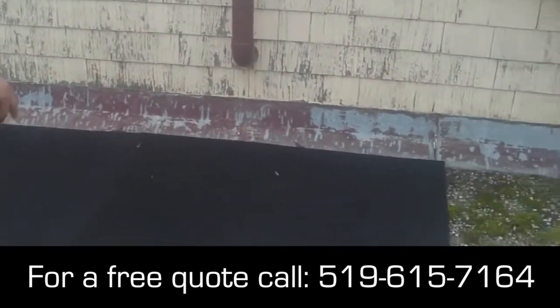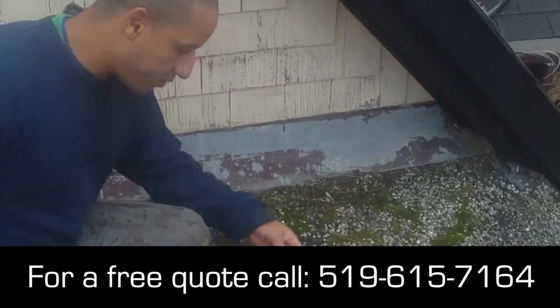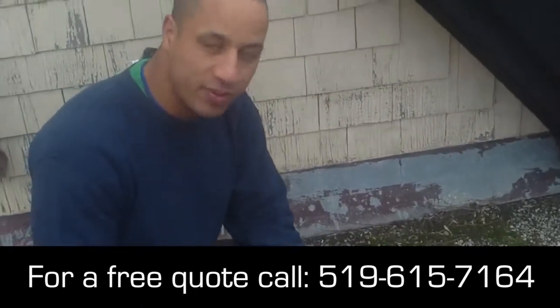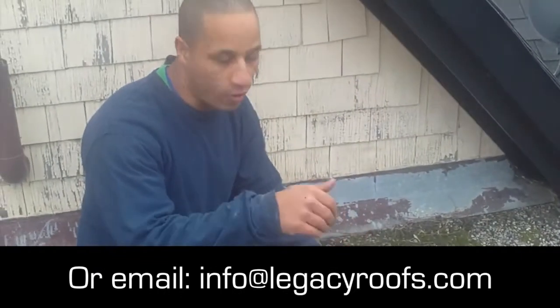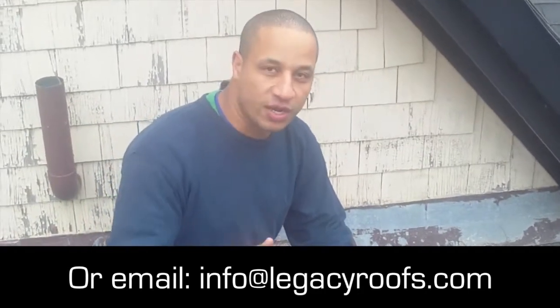If you can tell here, there's a lot of moss that we had to remove. This is just evidence of moisture growing within the roofing plies — it could be just on top of the roof or it could be within the roofing plies. So we moved a lot of it. We're putting on a new soaker board to give it a new substrate and we'll go from there.